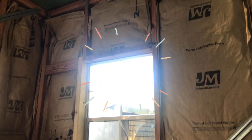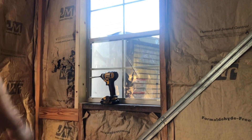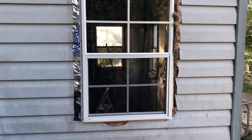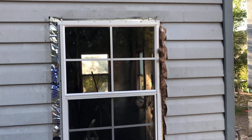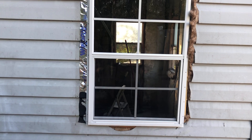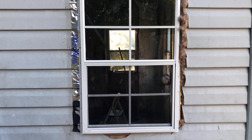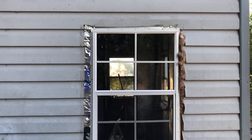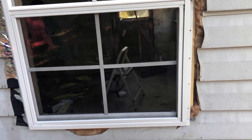And there you have it, we made it fit! The inside at least — the outside needs a lot of help. Clearly we had to cut the siding off of it. What I think I'm going to do is put the flashing all around it, and then once the flashing is on this side I'll go inside and put like an expansion foam just to make sure that it's nice and airtight. But it's not horrible for the first time, at least I don't think it is.